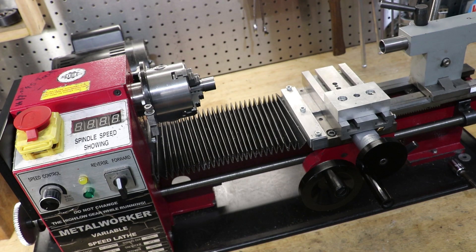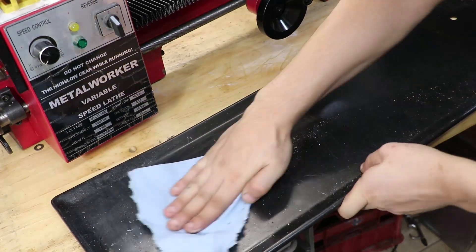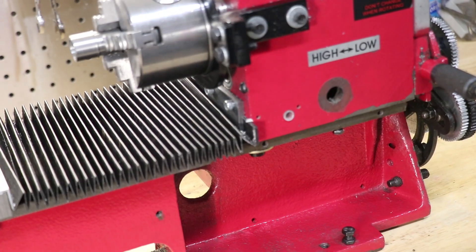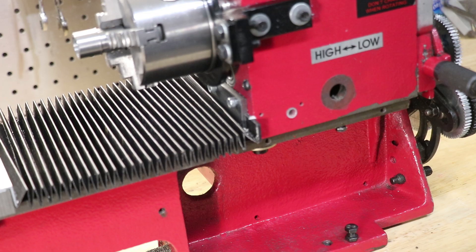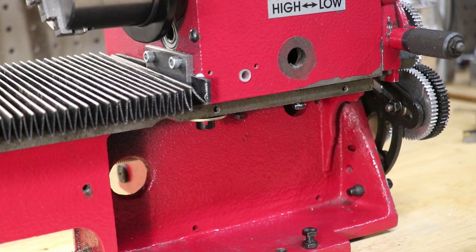To really show you, let me unbolt the lathe to get a better view. I haven't done this in a few years, so there's a fair amount of trapped oil underneath the bed. We're pretty much looking at the source of our problems. That void there is where the motor used to be housed before I replaced it with a much bigger induction motor. There's almost no material holding everything together — the headstock is really only being supported by material at the back and one small rib, and all of that is trying to stop it from bending.